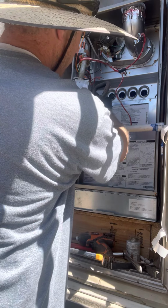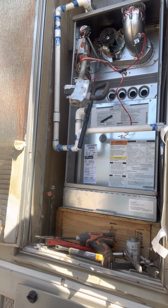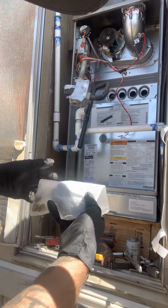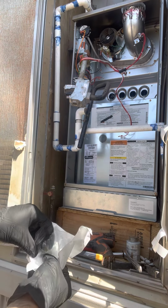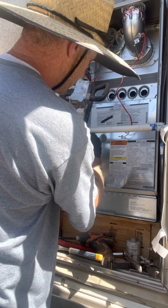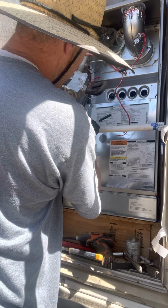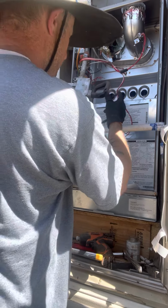So I have to use the orifice that is 1.25 millimeter. Pretty much it comes with some extras in there. Just gonna rip the package open. 7/16 socket gets these guys out, and pretty much all I do is I'm gonna start some threads, get it threaded in a few times, make sure we're not cross-threading anything, finger tighten those all down.